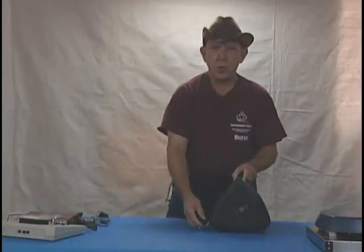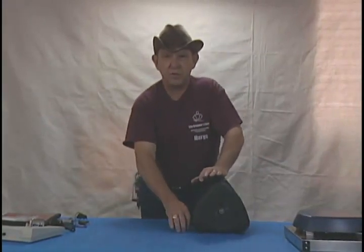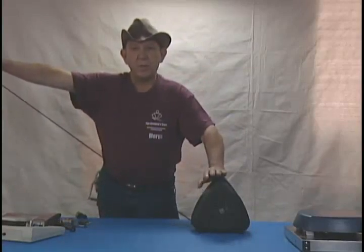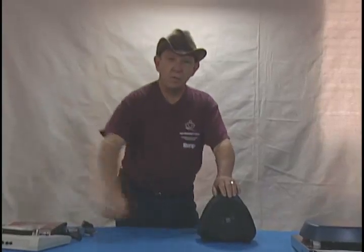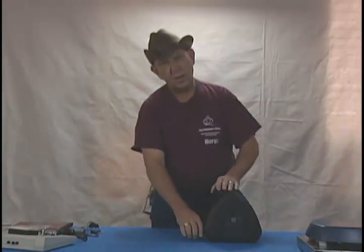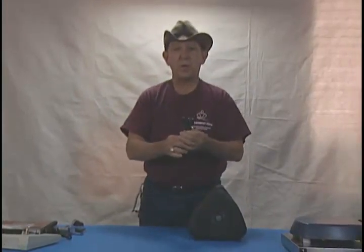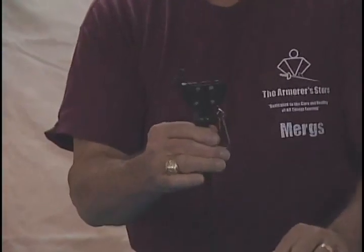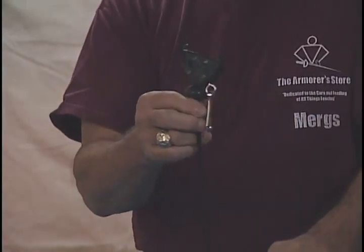One of the things you don't want to do — and is about the only thing that an armorer will probably invoke the death sentence for — is taking the cable from its full length of 20 meters, letting it loose, and letting it run and slam all the way back into the reel. First of all, it puts a tremendous strain on the wires at the connector and will cause them to break. That's your most common problem with reels: breaks within the wires at the connector end.